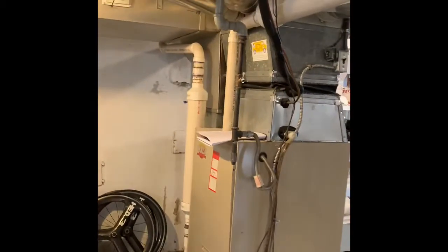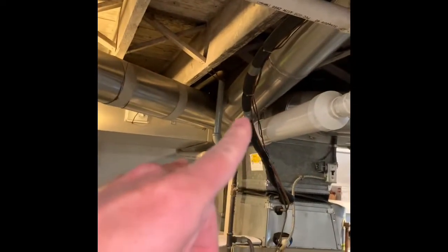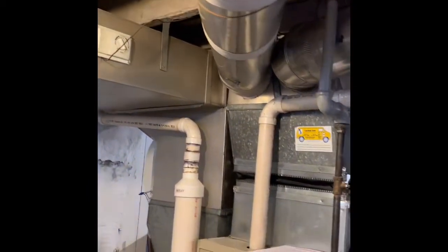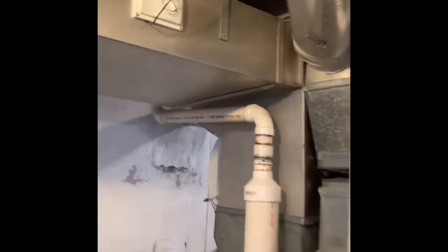Here's our inside portion — we've got two 2-inch PVC pipes we'll rework. It looks like there's a slight slope on the closest PVC; if not, we can cut it off here, go through this way, 45 down that way. And that's the other PVC pipe going that way.